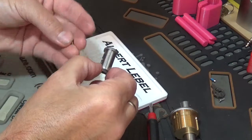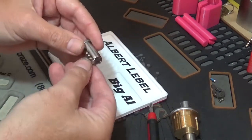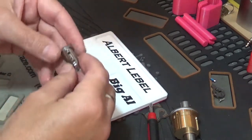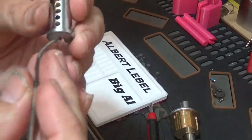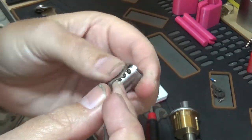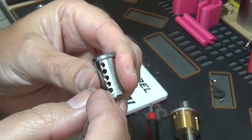And you know what's weird is I'm pulling standard pins out of here, but the core looks like it's threaded. At least a few of them are. I'm not sure what a threaded core is going to do. Oh, my specs. Oh boy. Sorry about that. Let's see. Yeah, I don't know. When you thread these cores, yeah, it's threaded in 1, 3, and 4. 5 looks like it might be just a little. Oh, okay, it is undercut. Yeah, really big undercut.